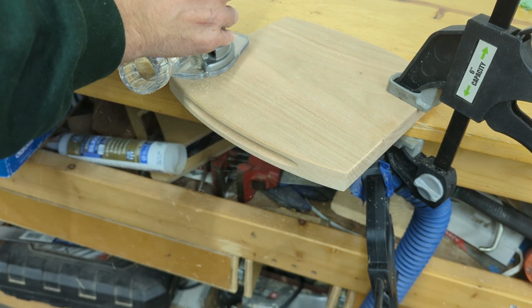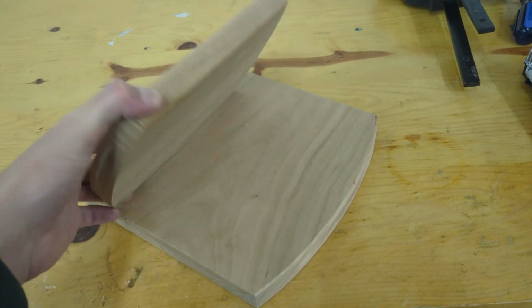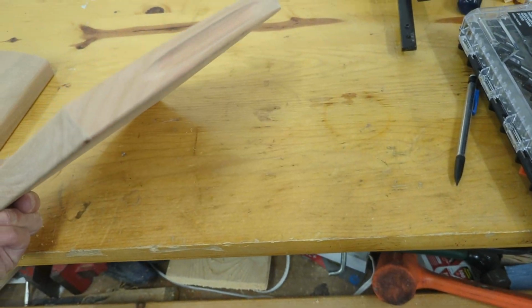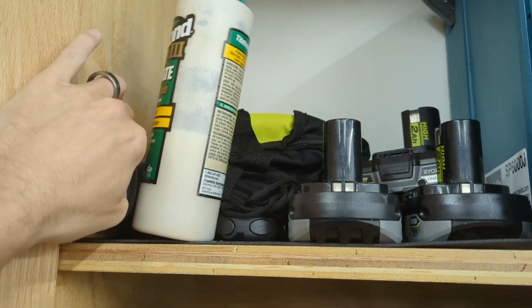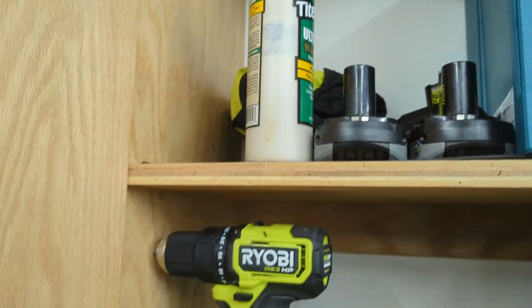I got my sanding and finishing instructions from my old man. He built many wooden boats and has also recently gotten into cutting boards. He said sand down to 150 grit, water pop, then 220 before a coat of oil a day for 2 to 3 days, and then wax a couple days later. Quick and dirty, right? But honestly, his come out crazy smooth, so let's give it a shot.